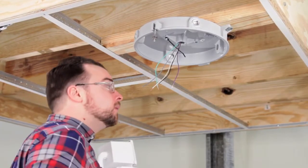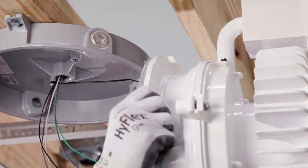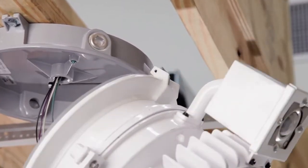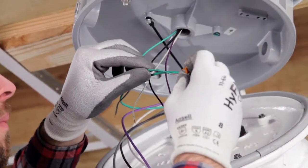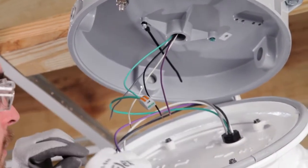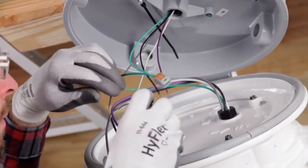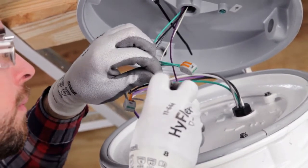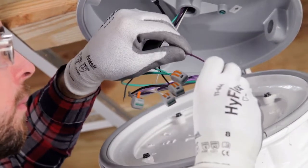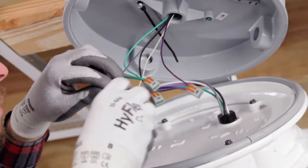Hang the PXLW luminaire hinge pin on the existing top cover hook. Inside the PXLW luminaire's wiring chamber, make the appropriate supply and ground connections to the luminaire's wires in accordance with local codes. Use purple and gray wires to make dimming connections if provided.